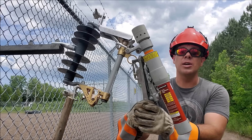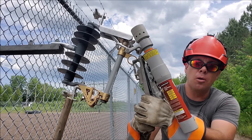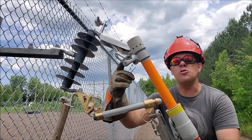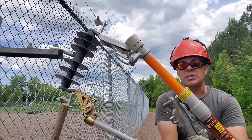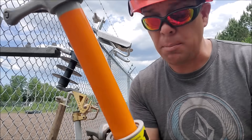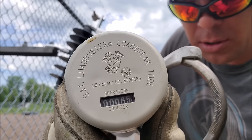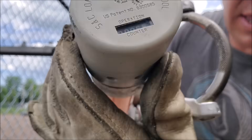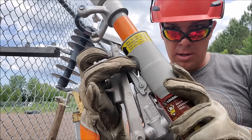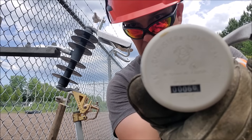Get your stick in place, turn your head away to the side, and give it that one firm downward pull. You'll hear a click — there should be very few sparks; a few sparks coming out is normal. Then twist it to the side, the door falls off, and remove your loadbuster — super easy. Before we reset it, if you look at the top you'll see there's a counter that reads 65. Once you reset the loadbuster — grab this little collar and give it a tug — it is now reset and that counter moves up to 66 operations.